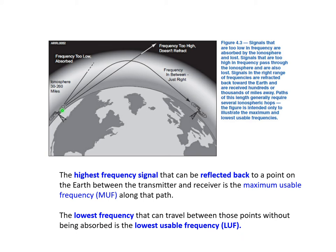Let's say, for example, VHF and UHF are both basically line of sight communications, where you can pretty well communicate from a line of sight of the antenna to the transceiver, but you really can't get distance on it because of the higher frequency. The frequencies don't bend by the ionosphere, and they just go out into space, and people out here can't pick that up.